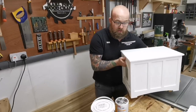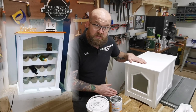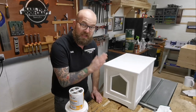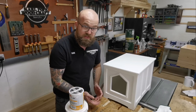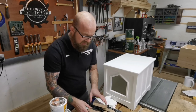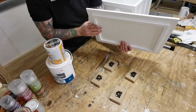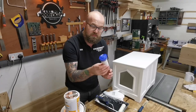Here's an example of this cat box — you can see the great finish. This is standard MDF, not MR MDF. As long as you sand to 240 grit, use a good quality primer, and then sand in between each coat with 240 grit as well, you'll get great results. We do one coat of primer and three coats of top coat. On your last coat we use 400 grit to sand the edges. If you're using MR MDF — moisture resistant — it works even better. These little painting stands are really useful: you paint the inside, flip it over, and only the very tip of the pyramid points touch your paint, so you can carry on painting the top.